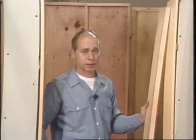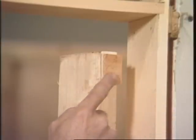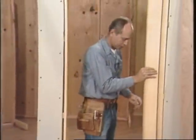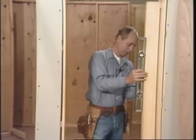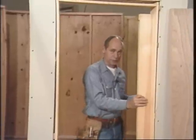That's how I go about setting an interior jamb. I use a plumb bob because it's fast and accurate, but you could also use a straight edge like this one — it has parallel sides, and I have a little block, one on the top and one on the bottom. Just put this against the jamb side and you can use any size level to check it with. When it's plumb, just flip it around and use the straight edge for shimming.